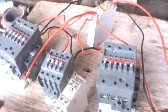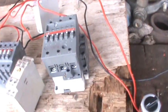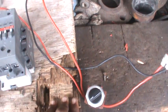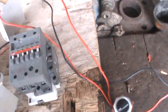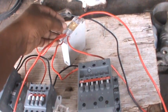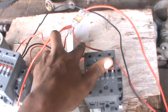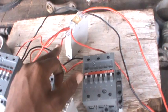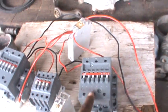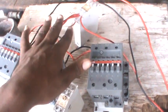I did this to incorporate an auto transformer inside there, but it's still a star delta concept. Two wires come out of your start switch: one goes to 15, and one goes to A3. 15 is connected to 16, which energizes these two coils. A3 is connected to 18 — so after a time delay, these two wires are going to cut off, and A3 is going to send power to 18 and energize the run coil. The timer is the most important aspect of this system — you cannot do it without the timer.